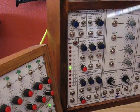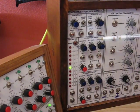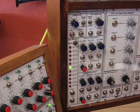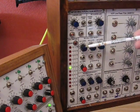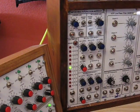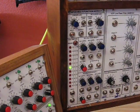The RC curve lag processor has similar features. The only difference is you get an RC curve. We also have two DC voltage mixers. There are three inputs each. We have two outputs — a normal output and an inverted output. Whatever you put into the inputs comes out in the normal way here; it follows the voltage, whereas the inverted does the opposite of whatever the voltage is coming in — it's 180 degrees out of phase.